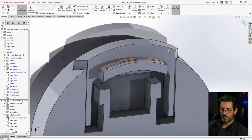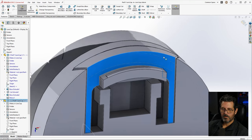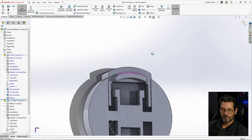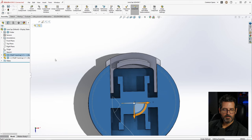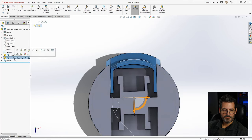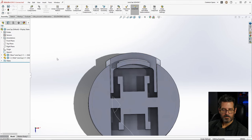If you come into the assembly and you want to move things around and you can't, it might be because you're in part edit mode. You can move other items, but the part you're editing, you can't. Okay, so let's name these things over here. If you select in the tree and hit Shift C, it'll collapse everything. And you see we have part 5 and part 6. Let's just go ahead and give those names. So select it again. It'll go to rename. I'm going to call this base. We're going to call this slide. Okay, now I can tell what those things are.